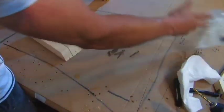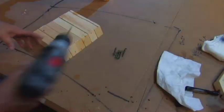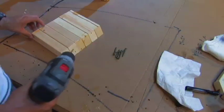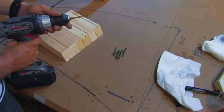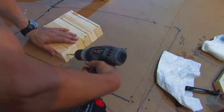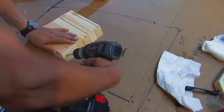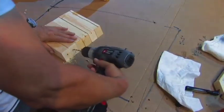I have six two-inch wood screws — these are outdoor screws. You can use regular drywall screws; these are probably the ones with the coarse threads. The fine threads don't seem to pull as well and they can strip out. This is a three-sixteenths inch drill bit. You're going to want to drill a hole in the end of these like this, and you want to go in at an angle, almost matching the angle that this is.